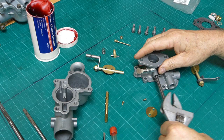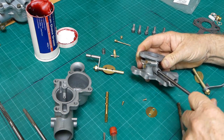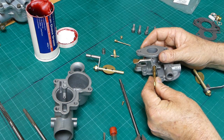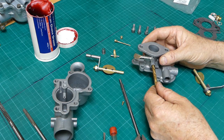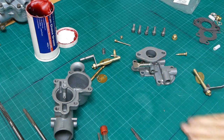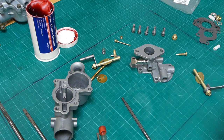I'll skip my little shifting spanner here and I'm looking to keep this as true as I can as I go through. This will probably follow the bore that's there. Now with the ream you never turn it backwards - you always turn it forwards. I've just gone in a millimetre or two. You need it to support the shaft evenly but loose enough that you can get a free flowing movement so your governor's not working against that. This is a straight flute ream and this is a spiral flute one - I don't know if one will be better than the other. It couldn't hurt to clean it though.